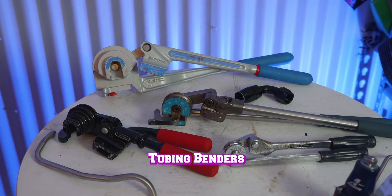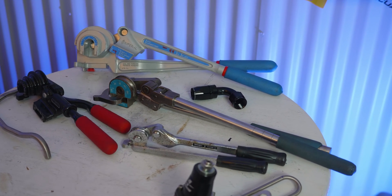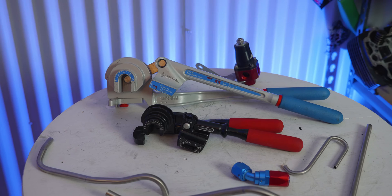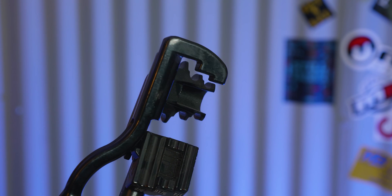Now let's discuss the most important tools for bending hard line — the benders. Obviously you need good quality benders for good quality bends. The ones I use least are probably the ones you're most familiar with: the multi-groove benders with different grooves for different sizes of tubing. These are great for softer tubing like aluminum, copper, and mild steel, which is why they're common on tool trucks for mechanics bending brake lines or fuel lines. But for stainless tubing they're just inadequate — not strong enough. I've had the hook that holds the tubing break off, and I've even had the pivot point shear off mid-use.